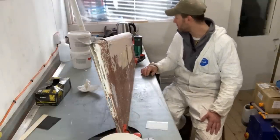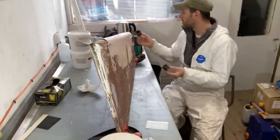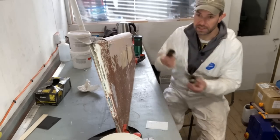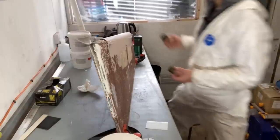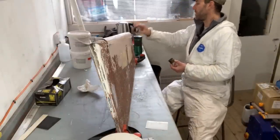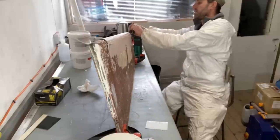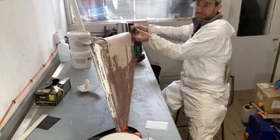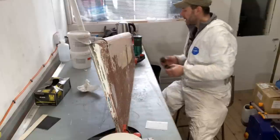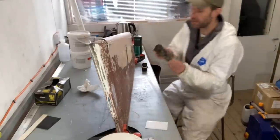The other thing I'm going to be doing is I have the rudder bearings from this rudder off his boat. So there's two of these, they're little kind of top hat shaped things like that. One is at the base of the cockpit, so right at the top of the rudder stock, and one is just on the other side of the hull, underside of the rudder tube, I suppose. And then there's a third plate here. This is what's called the heel plate that goes on there.